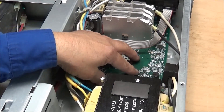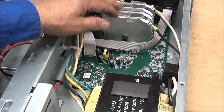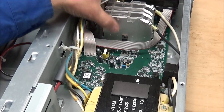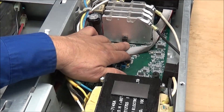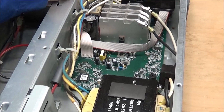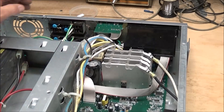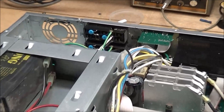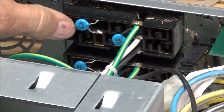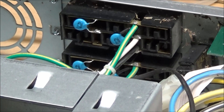There's a little main circuit board, and some big aluminum heat sink plates here with transistors - some kind of regulation going on. There's a USB board here on the back, and AC output sockets with a couple of MOVs on them. But I think I see why this thing failed.